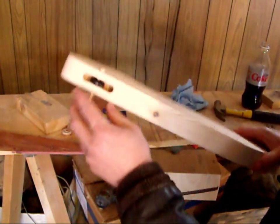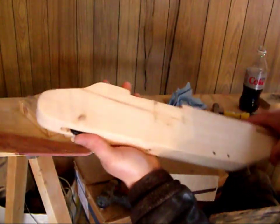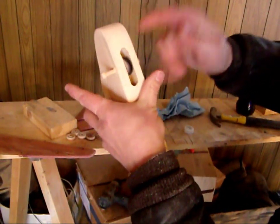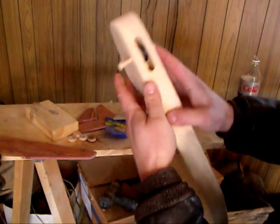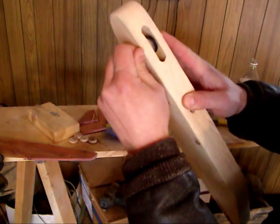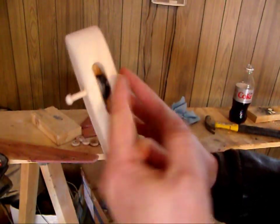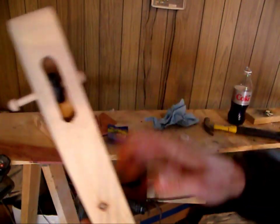What I've gone ahead and done is I took one of the wheels, put it in our route, and I've got some glue on the outside and on just the inside of this hole. You don't want too much because you want the wheels to spin. I stuck that dowel in and it left a little bit on the other side — about half an inch, give or take — and so I stuck this other pin in there. Now we're going to cut that off and take it to the belt sander and sand that flush.